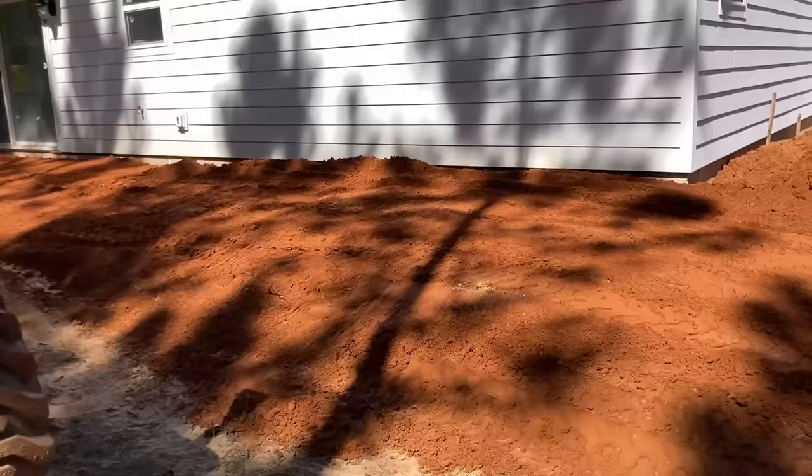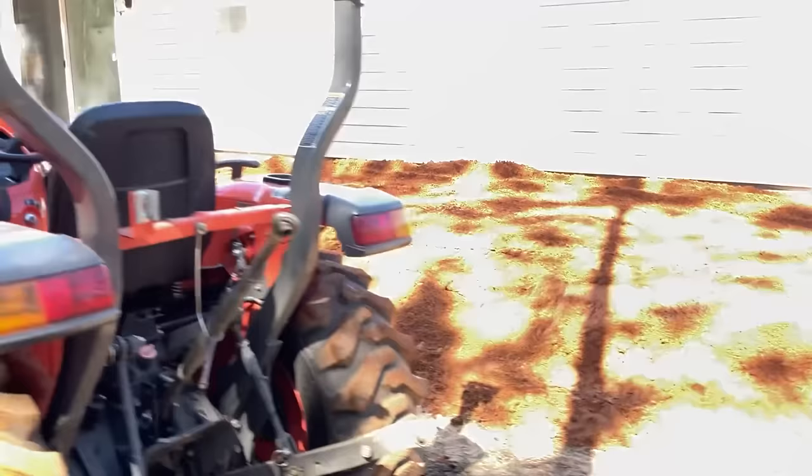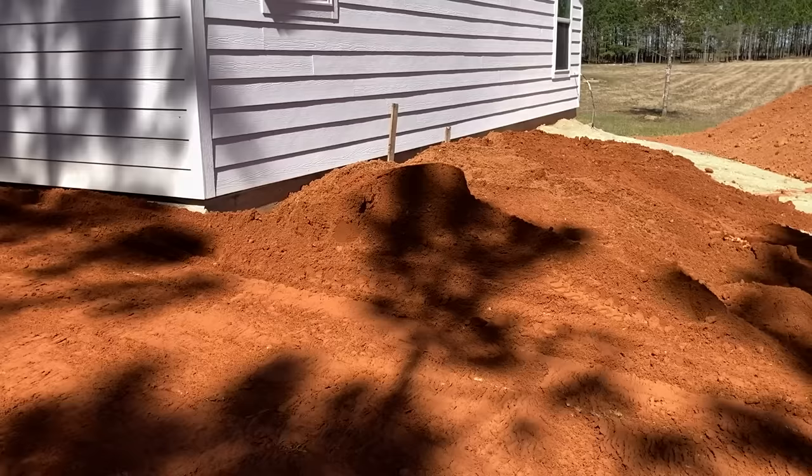I back bladed a little bit — it's a little humpy right here in front of the camera. I've got Bella as my helper. What I'm going to do now is grab a shovel and go up against the foundation to get the dirt packed in good, then work it more with the tractor. That's significant progress — one load of dirt and I've done the south side and a little bit of the east side. I've put sticks where the hot water heater and sewage clean out are so they can find them to plumb that up.